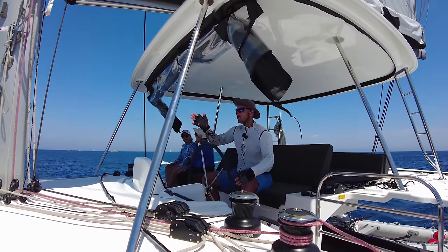But then we just left it like this because we were expecting south winds, and 1500 RPM reverse is a lot of strength, which we were just not expecting to have on the anchor tonight. Now, if we were expecting higher winds or higher forces on the anchor, this wouldn't be good enough. We'll take a dive later to see how it is. So I would just re-anchor somewhere there. But you don't want to re-anchor all the time. So if you're sure about the winds and you have enough strength on the anchor, you might leave it like this, although it's much smarter to redo it and really dig it well, especially if you're not sure about the winds that are coming or you're not familiar with the area.